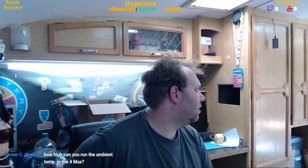So yesterday I had a problem with my Ender 3. I put a filament in it, set it all up to print, and it just wouldn't stick to the bed, it came loose. Later on I worked out that I'd put ABS filament in there and was trying to print at PLA temperatures.